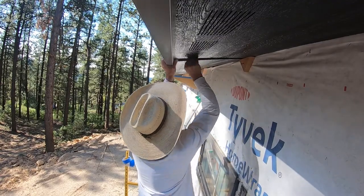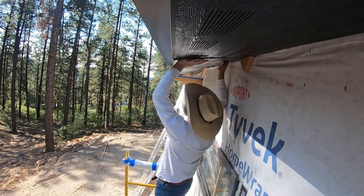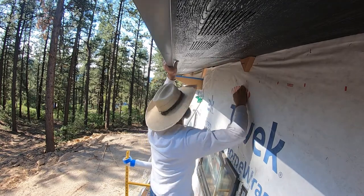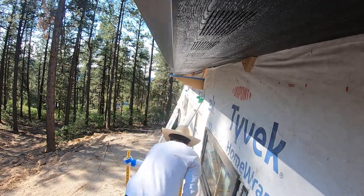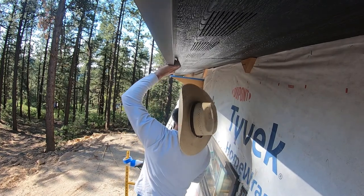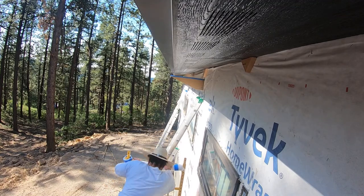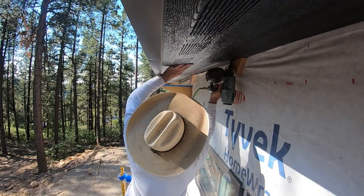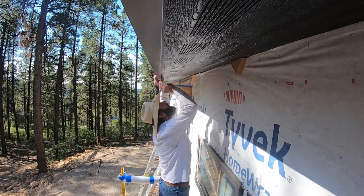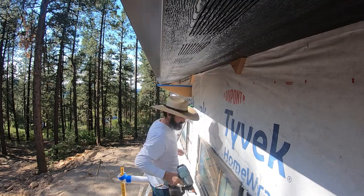Here's a little better view of what I've got going on — you can see the little block keeping it up there. What I'm doing is trying to keep these seams nice and tight. It's good to have a little bit of a gap, but you want it to look good and be tight — probably a sixteenth of an inch, pretty small. Right there you can see the Hitachi coil nailer. I basically go through, find the studs, and put three nails in there.